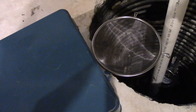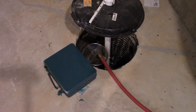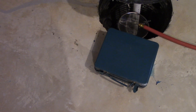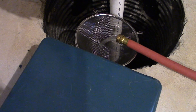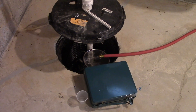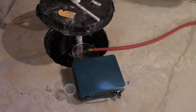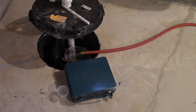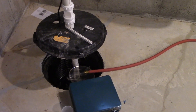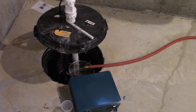So put the hose in there and you can drain it that way. I have the hose in there over the strainer. Let's go ahead and open the valve back up and see what happens. Much more water coming out as you can see. So we're going to go ahead and let the strainer catch the remaining water. As you can see we've gotten all the water out of the water heater. It came out pretty clean, which is definitely a good thing.